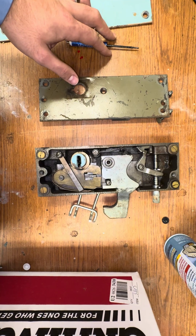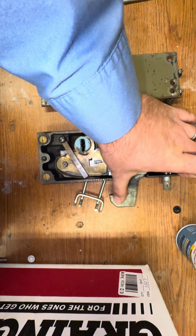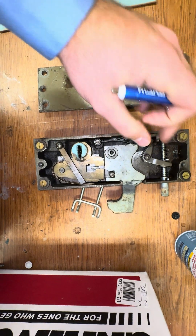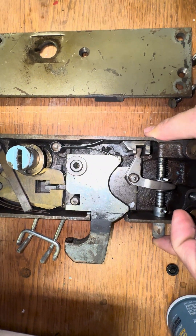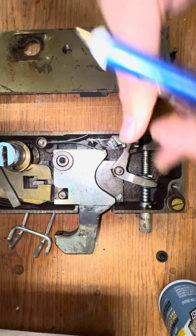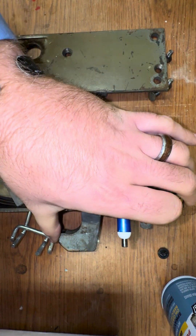This is the sliding latch style, so this latch right here moves really up and down. Of course, the only exception being this dead latch right here, which goes ahead and traps the latch from actuating once it is depressed.